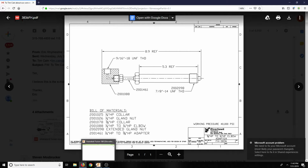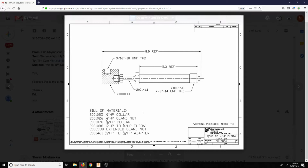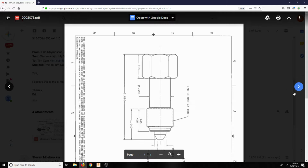Maybe we'll go in here. And also, one of the things I want to do in this video is design this manifold, which now will help me machine once, and I just need to drill 2 holes and 3 holes into an aluminum block, and then tap 3 sides, and then I'm done. I don't have to do any sort of crazy cutting and welding and making sure that there's no leaks or anything like that. Really good. So 2 swivels, that's nice.